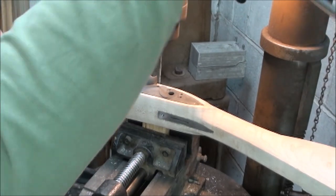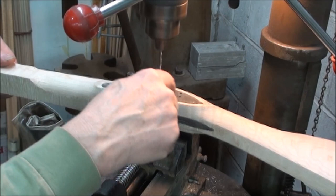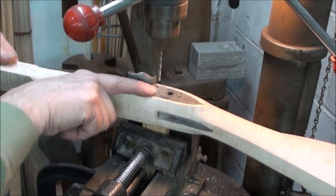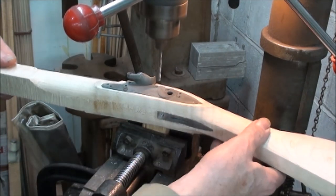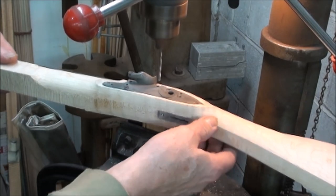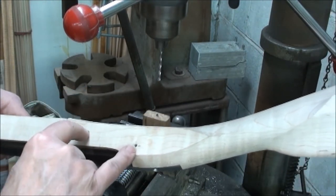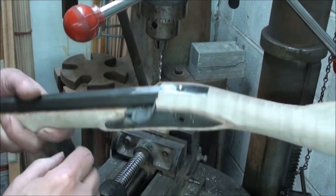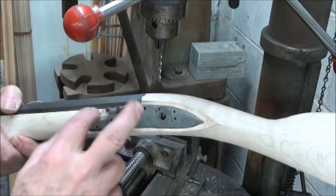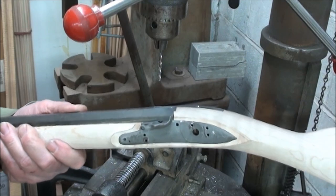When you drill in this way you're going to be going through the bolster probably. If you feel it hit the bolster and you know you won't go completely through but might nick the back edge of it, take the barrel out and finish drilling — otherwise that bolster on the back of the breech plug might throw your bit off a little bit. Then you can go back and file the rear of the breech plug with a U-shaped notch to clear for the bolt. Once you've got both holes drilled all the way through, go back and drill out to the final size for clearance. These I've already drilled to the size I need for the taps — I'm using 8-32s, which takes a 9/64 bit, then I'll use an 11/64 for the clearance holes.